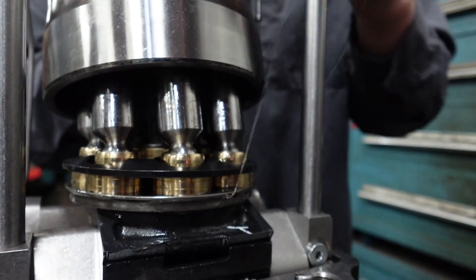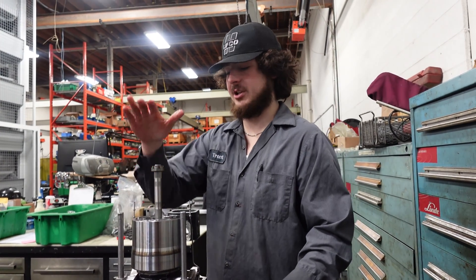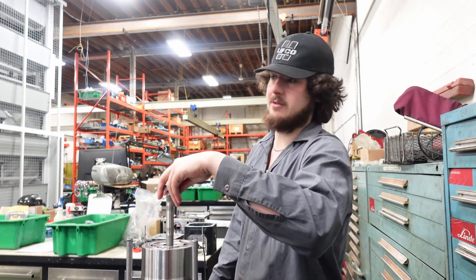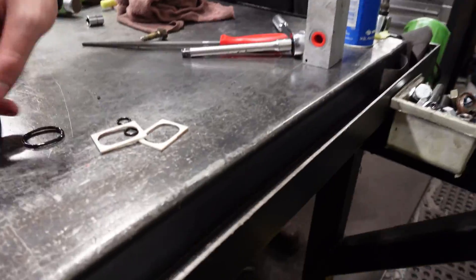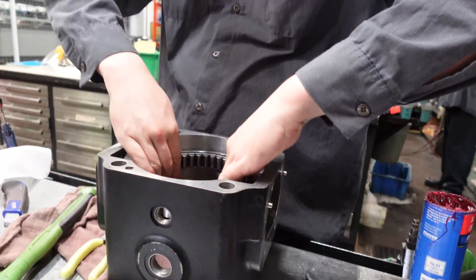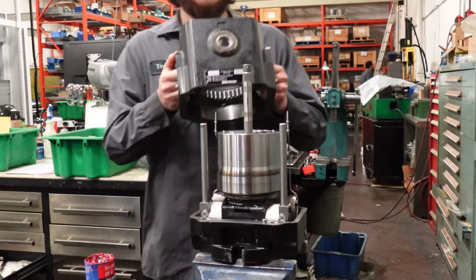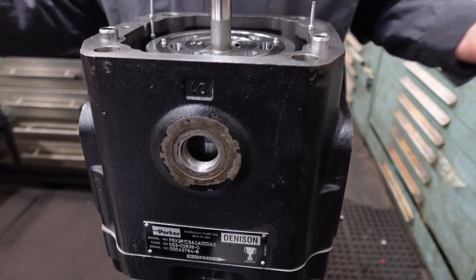You've got to match up your slot with your piston. Sometimes you have to lift up a little bit, and if you lift up too much you basically have to start over. So now it's in but it's not engaged. I'm just going to spin the shaft a little bit — now it's engaged. My arc shaft is dropped, so I'll throw the nut on here. Gaskets, just like a seal, always get replaced — Teflon seals, new O-rings, new gaskets all around. This is already clean.